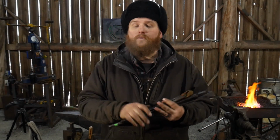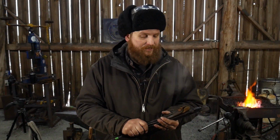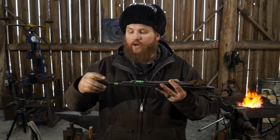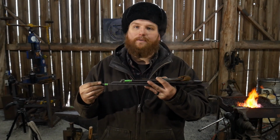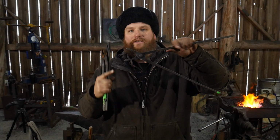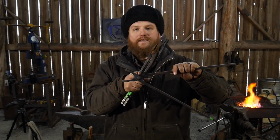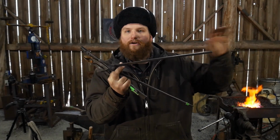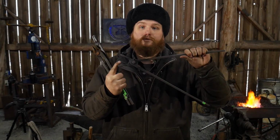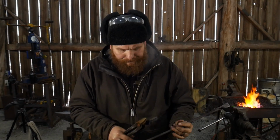The point that I was making in the live stream myself is that with longer reins on your tongs, and the shorter the nibs on the end, the higher the output pressure you can get through leverage, because this is a lever at the end of the day, and the longer the lever is out here, the more work can be applied to the actual jaws of the tongs themselves. And so I like really long tongs.